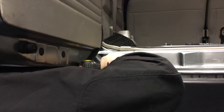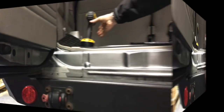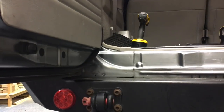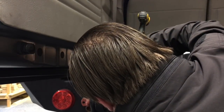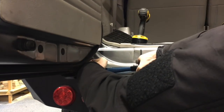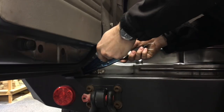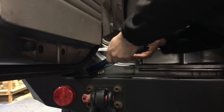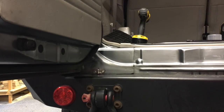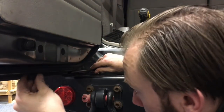I'm not going to lie, it was a little bit open. Finish those holes off with a little bit of clear lacquer. Now you can line up the bracket with the rivets in place and use the rivet gun to secure them. Pop the gas strut onto the bracket and use its extended length to measure the point where it will attach to the barn door.